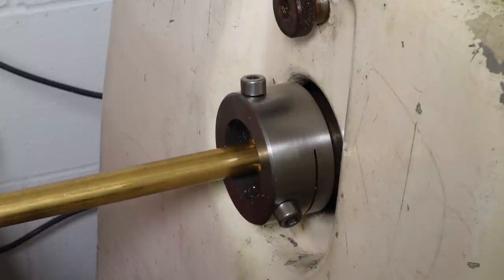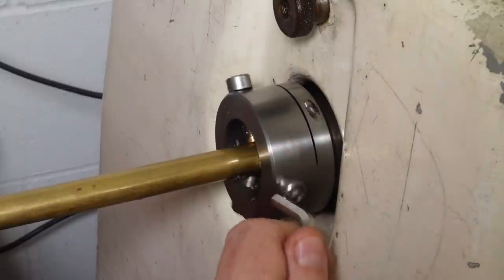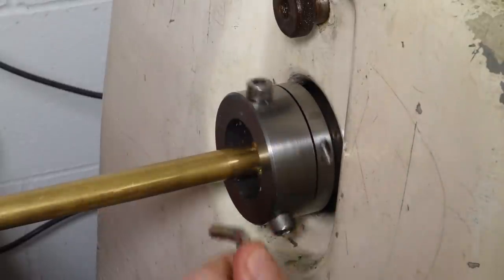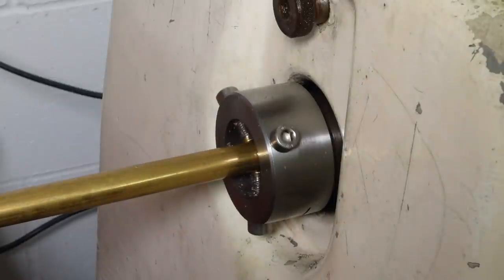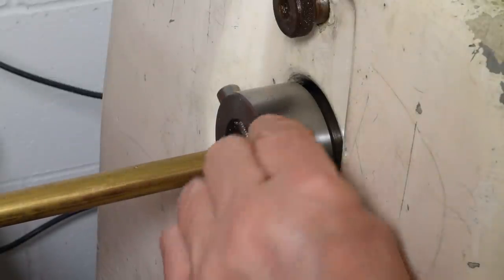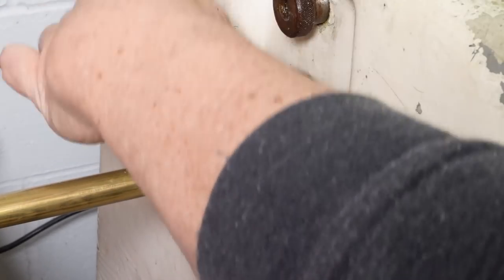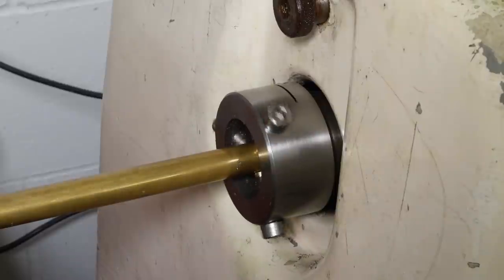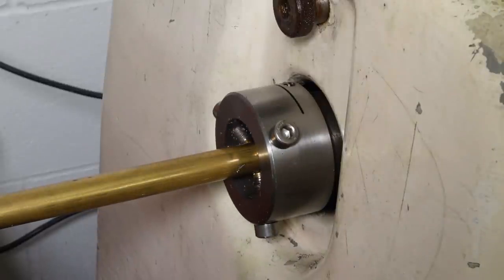Adjusting the bar for concentricity is a bit more complex with 3 independent screws. Unlike with a 4-jaw chuck, the side-to-side and up-down directions interact. But if you remember that moving one jaw by a certain fraction of a turn then needs compensating by turning the other two exactly half as much, it soon gets to be second nature. The 3-screw version was originally intended for holding hex bar and to lock custom Delrin bungs in place for material smaller than 1/2 inch diameter.